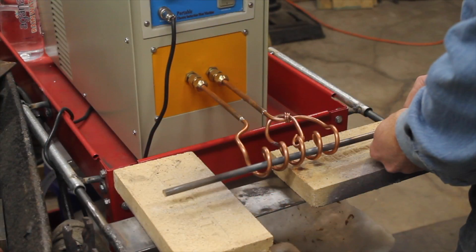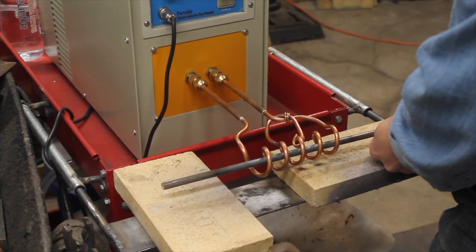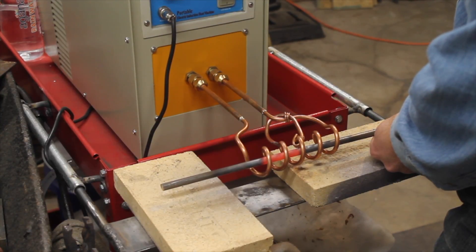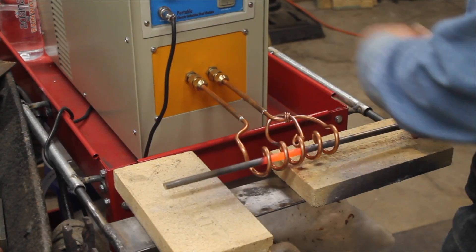As a final topic, let's look at how I tested a third coil without actually making it. With my long coil, I thought it might work better with fewer loops, so I shorted out the last two loops — this is standard practice in developing coils. I used some scrap 6mm tubing and carefully crimped one end onto the coil, and secured the other end with a short length of 10 gauge wire. Don't use vise grips or plastic spring clamps — they will heat significantly. You must use very heavy gauge, something in the range of a welding lead. It doesn't appear to heat faster, so the limiting factor is the loop spacing. That suggests 5 loops is reasonable for a 1 inch diameter coil, and that the coil spacing determines both the physical length of the heat and how long it takes. So if I find I often want a 3 or 4 inch heat, I'll make another 5-loop coil with appropriately tighter spacing.